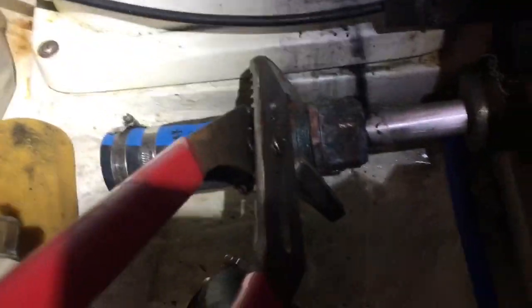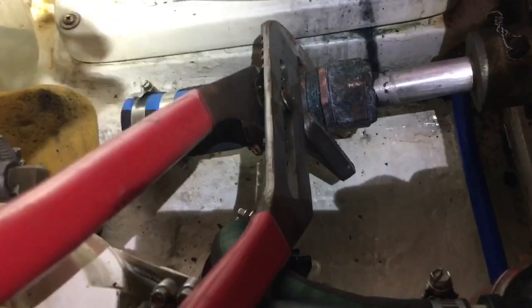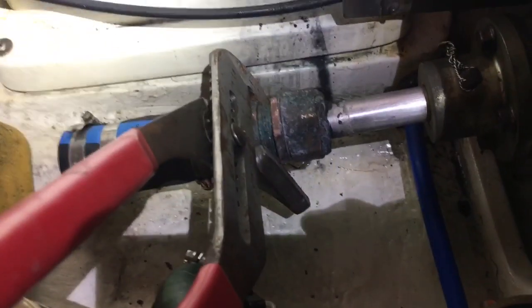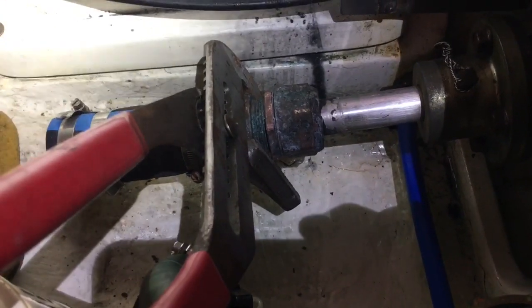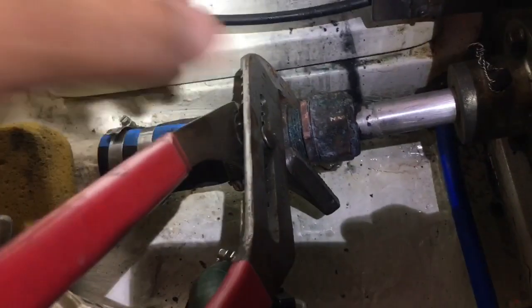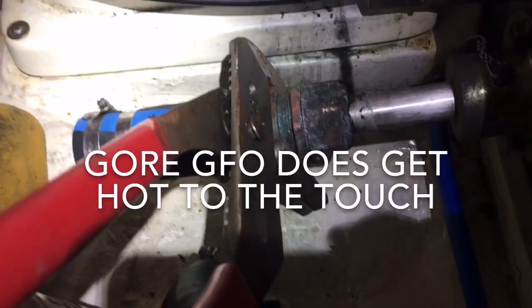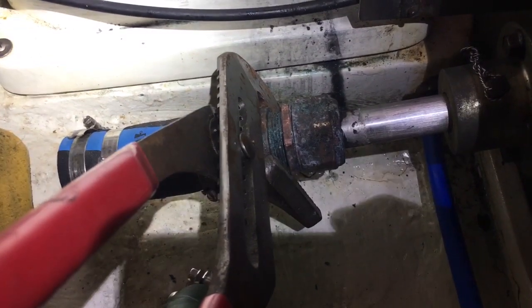This is my impression of what Jeff Hare said — not exactly what he said, but my impression. If you get this too tight, you could almost put water on this nut and it will blow smoke — I've actually gotten into that state before. The normal state, according to Jeff Hare, is that you should just be able to touch it and not hold it for a long time because it's going to get hot. I've been tuning this about once every year for six years and it still seems like it's got more to go.